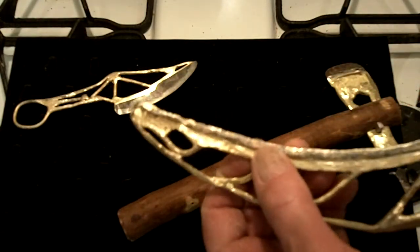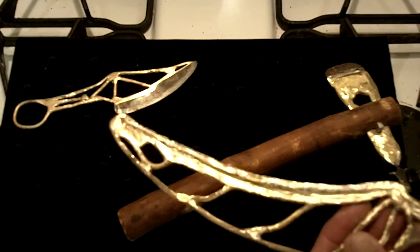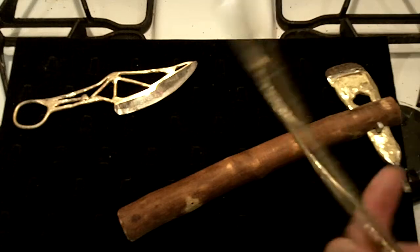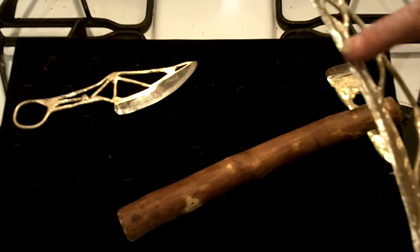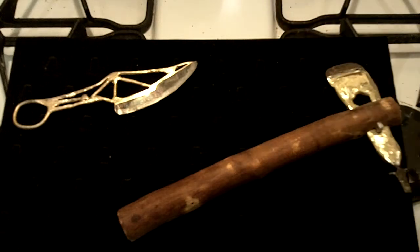It's an excellent saw, and this one is hollow ground on both sides. But I did once again add something. I etched these iron pellets, and then I pounded them with a hammer, and I brazed them into here so that when you polish this blade, it exposes this alternate of bronze and steel, so it makes it serrated. And this I would bring with me for bushcraft.